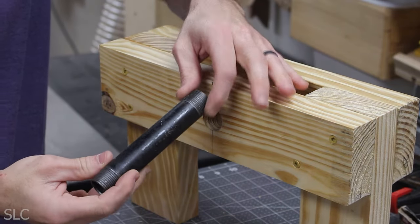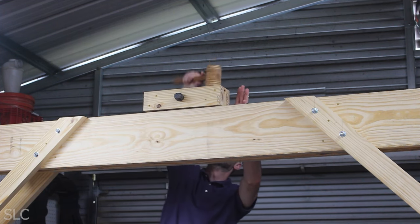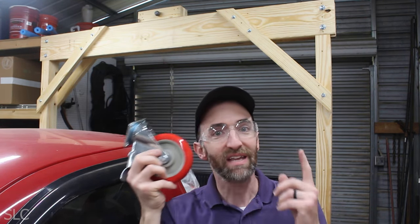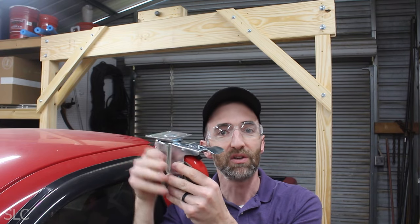To go through this hole, I'm going to use a 6-inch black steel pipe that I plan on securing on both ends with some caps, just to keep it from falling out. Now the gantry is pretty much done — that is if I wanted to leave it exactly where it sits and never move it. Occasionally I'll need to move things around, so I'm going to install some large 5-inch casters. Installing casters on a gantry can be risky because you don't want the legs to move around while you're working. So all four of these casters have the ability to lock the wheel in place and the spinnable base, so they should be nice and secure.